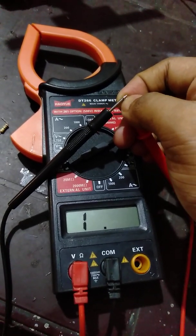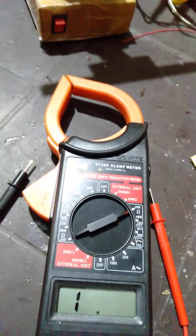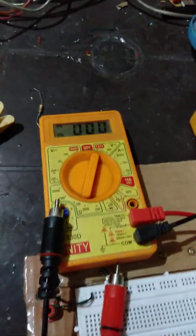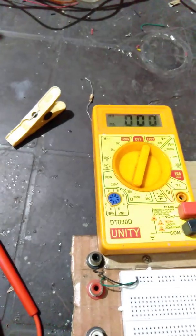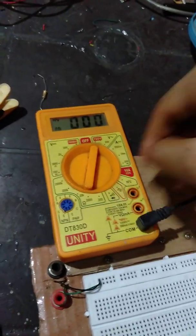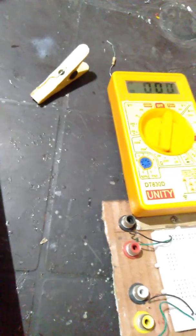Let's now see how it does with voltage. Our input voltage in home appliances is somewhere around 230 to 240 volts. This multimeter in AC voltage mode, the 750V mode, should be reading 230 to 235 volts. Maybe it's a bit high here because it's nighttime, so it can be high — I have no objections for that. It should read at least 240 volts. I'm going to use these terminals for the multimeters because the RCA connectors are not meant for going into plug sockets.